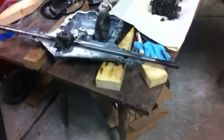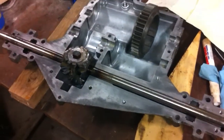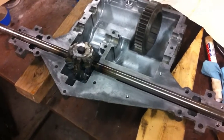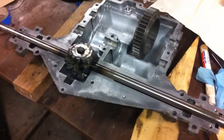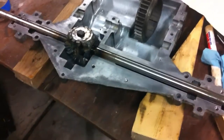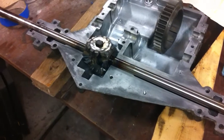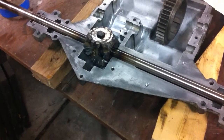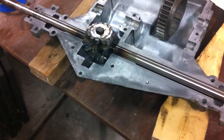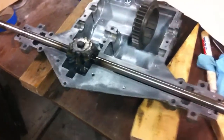We need to just give it some attention. Freaking heat up all the gears — heat up all the gears, because you're going to get a way better weld. Before you're welding, it's probably not a bad idea to heat them up as much as you can with the propane torch when you start welding, because it'll help preheat the gears and you'll get a lot better penetration out of it.